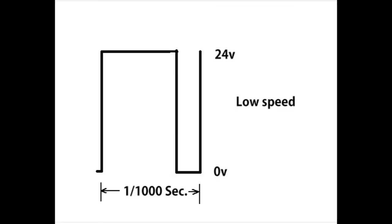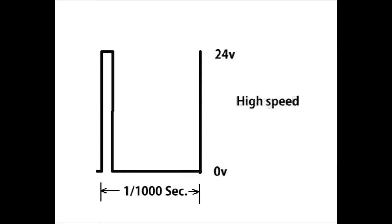But what sort of signal? It will be pulse width modulation, where a 24 volt output will be switched on and off 1000 times per second, with the on and off times varying to give the value. Not on at all for 24,000 RPM to always on for 0. How do we turn this into a voltage to feed the VFD?